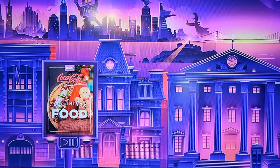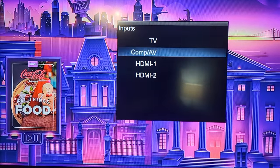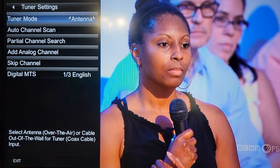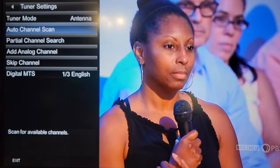If you have a TV with a Roku but it's not a Roku TV, go ahead and switch it over to TV as the input — don't stay on HDMI. Once you're there, go to the menu, go to settings. There will be a tuner option; set it to antenna, not cable, and then do an auto channel scan. This is going to take about five minutes, so play around on your phone. Once everything is done, we're going to see what channels we've picked up.